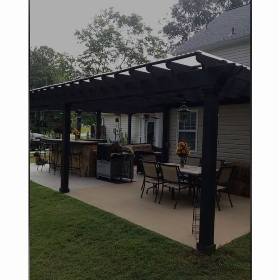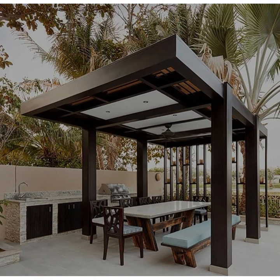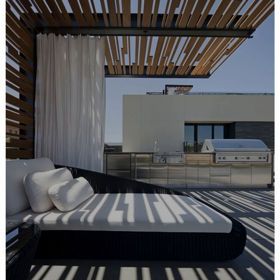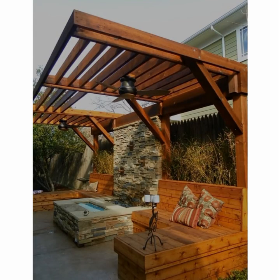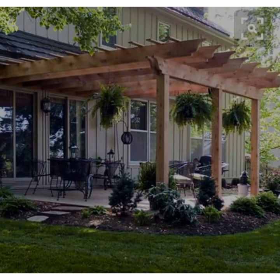Getting started on how to build a pergola — here's a summer project designed to keep you cooler on even the hottest of days. The classical columns support an overhead wooden lattice that works like a big shade tree, letting only a portion of the sun's radiance shine through. What looks like the toughest part of this project is actually the easiest: the graceful, solid-looking columns. They're not wood at all but a hollow-core composite material with amazing structural strength and durability. Simply slip these columns over treated 4x4 posts embedded in concrete.